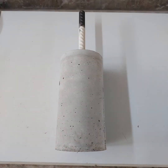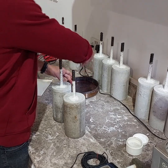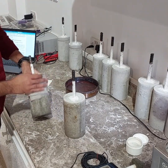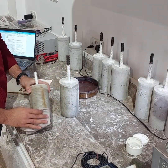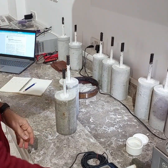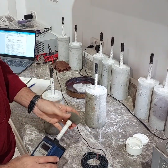First of all, we have to clean and dampen the surface of the concrete to ensure good contact between the electrode and the concrete. We can use a soap solution with a concentration of 0.5% in tap water. Be careful — the surface should be damp, not flooded, and the concrete must be damp enough for ions to flow so we can get a stable reading.